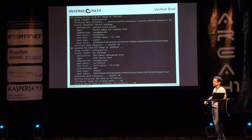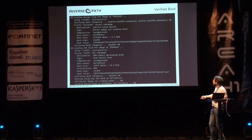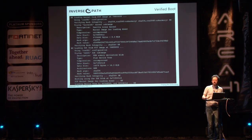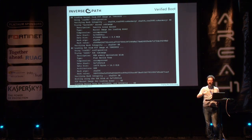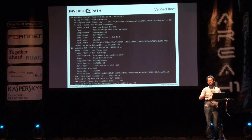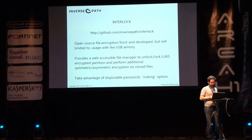So verified boot comes from U-boot, from the bootloader, which just verifies the FIT image. That's the terminology for the image that it boots, which contains the kernel and the so-called device tree, which is an external file which is parsed by the bootloader and the kernel to configure the hardware of the device. So if you want to assign a GPIO to an LED or change configuration of certain pads, that's what you do in the device tree. So when we set the device in host mode, that's where that configuration is, in the device tree file. Okay, so